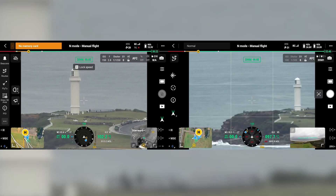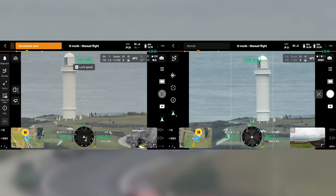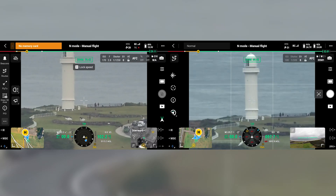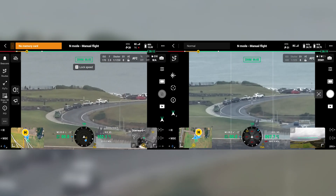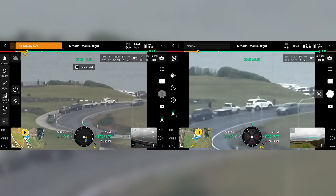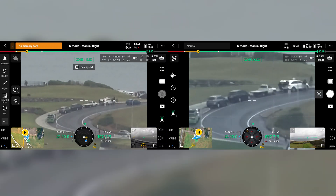At 56x the M4T is showing better resolution. Moving to 80x, the M30T is at 80x and the M4T is at 200x. You can still make out people walking around. We are now doing digital zoom — we've lost optical, but you can still make out objects. It's not as big a difference as expected. Going back to 160x, it's pretty similar, though the M30T is slightly better at extreme digital zoom. Zooming back for a closer range comparison, at 20x and 40x both look pretty good, though the M30T has a slight edge at fine detail like pins and insulators at maximum zoom.